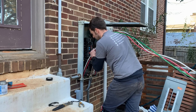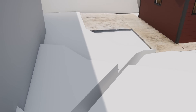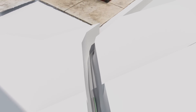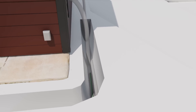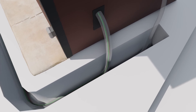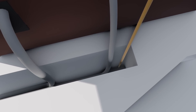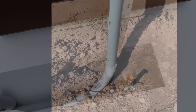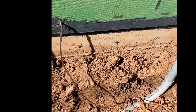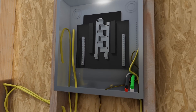The red and black wires are going to be our hots, the white is going to be our neutral, and lastly the green will be our ground. After pulling these conductors all the way out to the workshop, I next have to install an eight foot grounding rod. My local code requires this for a subpanel located in a separate structure. I'm just using a mallet to slowly pound this all the way into the ground. Once it's in place, this rod gets connected to a copper wire which runs inside and terminates on the grounding bar located inside of the panel.